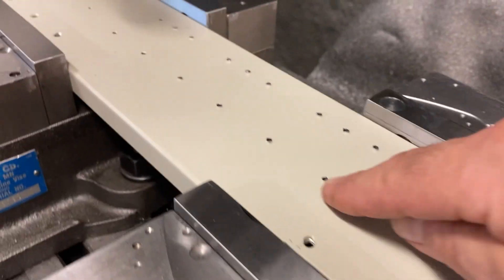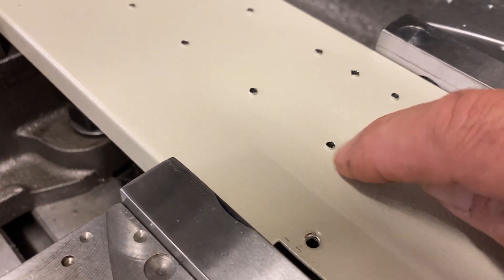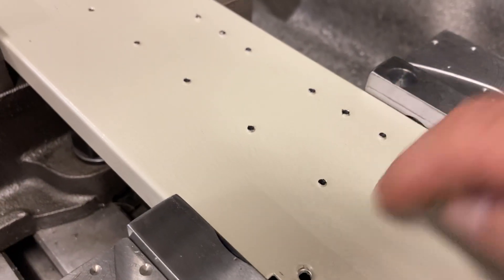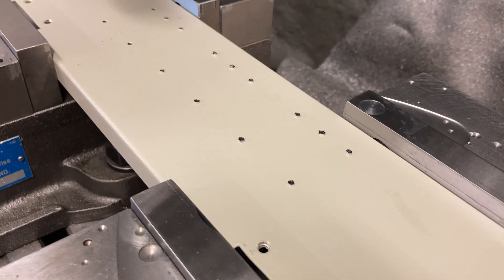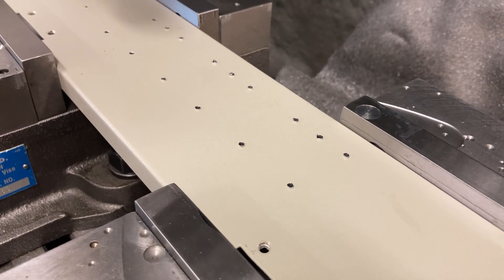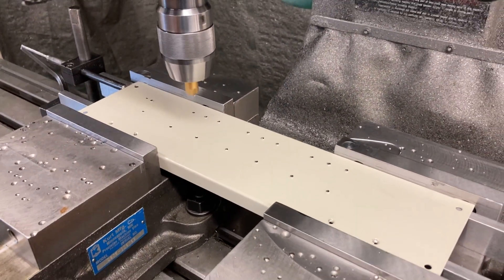Take the burr off the back side — that's just my suggestion when you're doing thin parts. This part's like 0.093 thick, and you've got this hanging burr on the back side of these steel pieces. Take the burr off before you tap it, because there's a good chance you'll break the tap when it comes through and grabs that burr on the other side. Just the tip — today's tip. Titan Machine Tool, signing off.